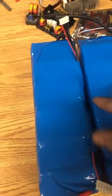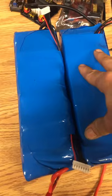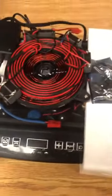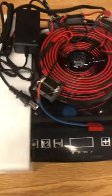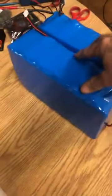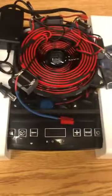If I build another one of these bricks — I may even build two — say this is 33 volts, then we've got 66, then a hundred, then about 130 volts, kind of like what's coming out of the wall. At 15 amp hours, four of these bricks would provide 130 volts DC at 15 amps for one hour, running this thing at full power for one full charge.